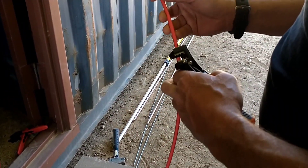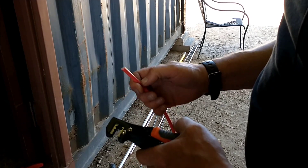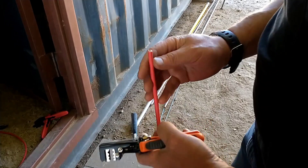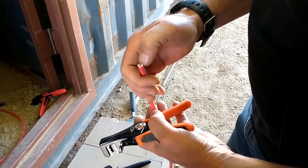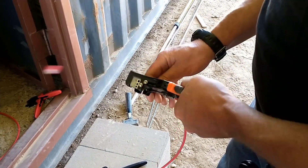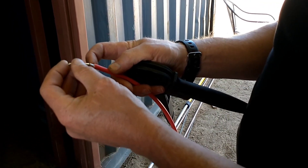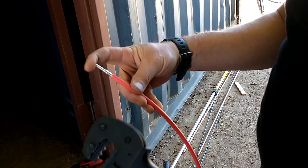I have to make up several links of cable to connect my solar panels. I'm using six-millimeter-squared wire, which is heavier-gauge wire specially made for solar panels — it has several layers of insulation including an outer layer that's UV-resistant and acid-resistant. To do that I first strip off a little bit of the end of the wire — this tool makes that really easy. Then I put on this male connector, which fits down perfectly over the wire.